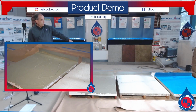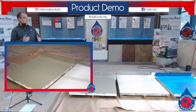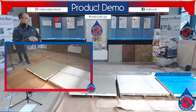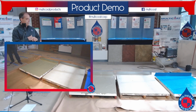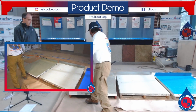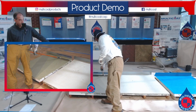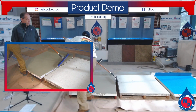The second board that we have here has our Multi-Base already dry. So it's ready for our first coat of Multicoat. Okay. So Alfonso wants to show you the magic trowel on the Multi-Base, just to show you how you can get a smoother finish at the top so that everything you put above it is smoother. So as you can see, how much easier it is than troweling standing up, and using the magic trowel gives you a much smoother finish.